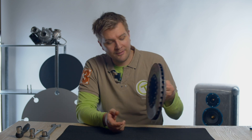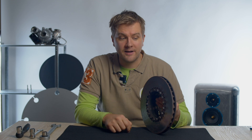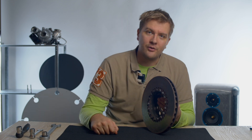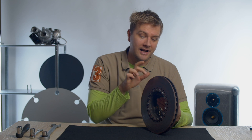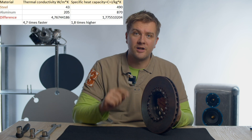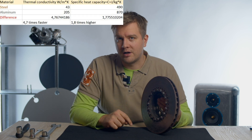We all know that cars have brakes and every car needs one. If you go fast you need to brake and take the speed out. What the brake does is change momentum to heat. When you design car brakes you need to dissipate a certain amount of heat inside the brakes, and that comes down to the specific heat capacity of each material, which is very important.